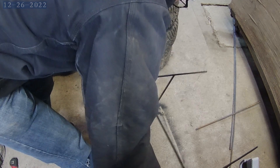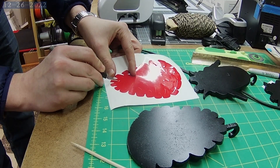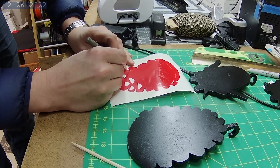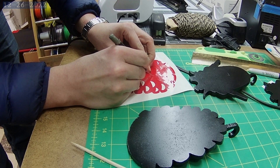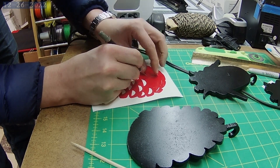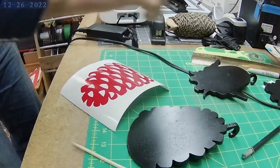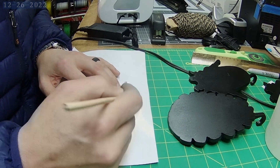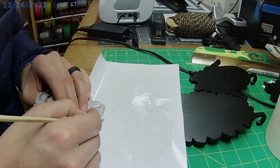After cleaning them up a bit, I decided to spray paint them black. This is where the same-size plasma cut file and the same-size vinyl cut file come together. I'm weeding out the extra vinyl here. I had four targets total — two Yosemite Sams and two pine cones. On one of each I put the little detail vinyl in, and on the other I put the perimeter vinyl. You can see me weeding out the extra pieces and using some transfer paper to apply the vinyl onto the actual painted targets. I think they turned out pretty nice, actually.